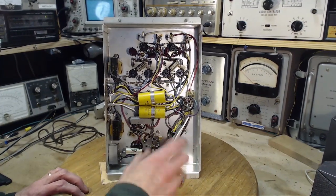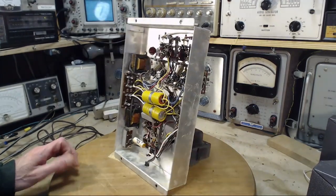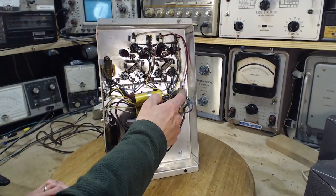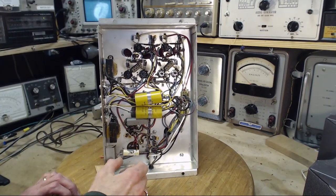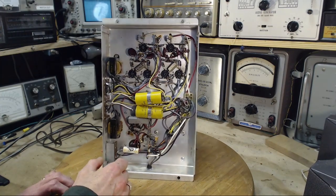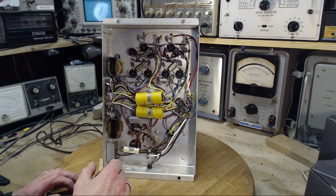Maybe there's a switch that switches the power on and off to the record player over on the receiver or something like that. But anyway, this is power. That's the thing to know. Not that this one here is particularly safe. It's going to have high voltage on it because the high voltage is developed here, and the receiver gets its high voltage from here.